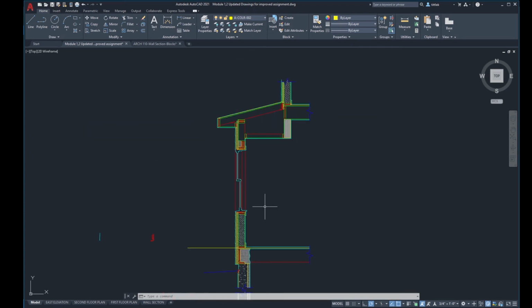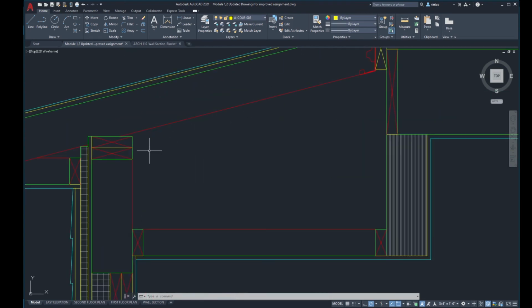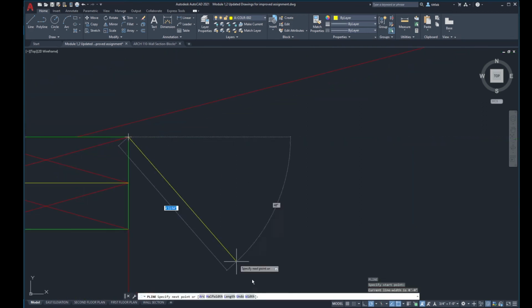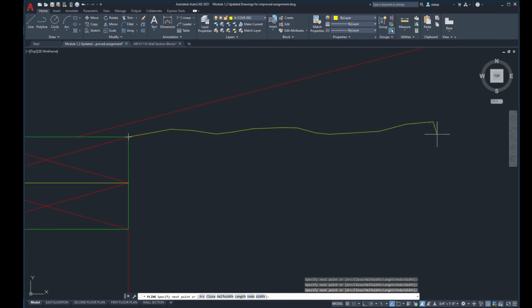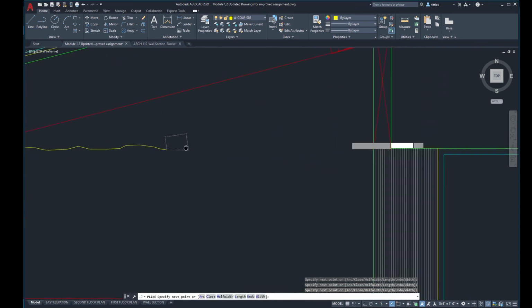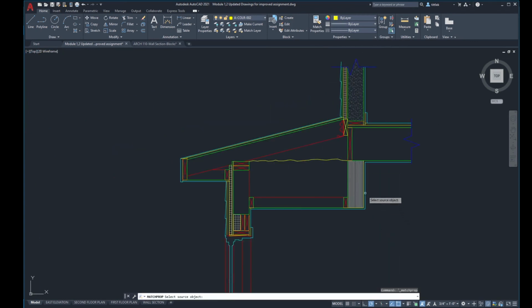And again, just kind of like the insulation here, with the spray foam. I like to, because the blown-in insulation in an attic, which is essentially what this space is, just sort of lays flat. So I do that again with a poly line, and I turn off my snaps and things, and I just kind of do that as a series of clicks, fairly rapidly as I move my mouse across, just creating this look of what that would look like if you just had a bunch of cellulose, which is nothing more than basically torn up newspaper. Let me get my snaps back on, come down to here. Again, that's the edge of a hatch, so I'll make that on the pattern layer.